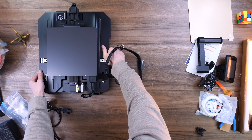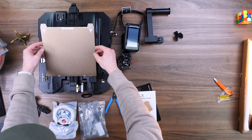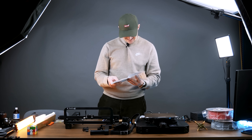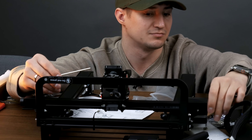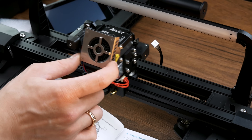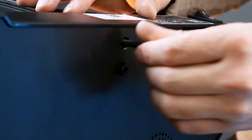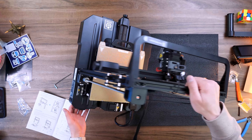All that is left is to assemble it, turn on and print our Rubik's Cube. We can assemble this printer like a construction kit. You just need a few bolts to attach the extruder to its place, and it will move along the X axis. Then we place a frame on the base, fix it with several longer bolts, and tighten them. That's what the printer will look like.